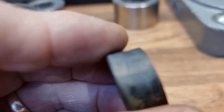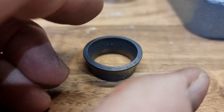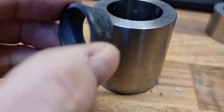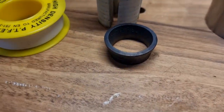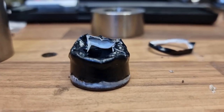The ring is oversized and still a cone, so what I need to do now is push the outside in. We use a different cone called a Swedish wrap die, but if we just pushed it through in the stainless steel die the metal would squish all of the detail away and we'd end up with a nice flat ring — which we don't want. So we wrap the die in loads and loads of PTFE tape and then an outside edge of electrical tape. Let's unwrap it and see what it looks like.